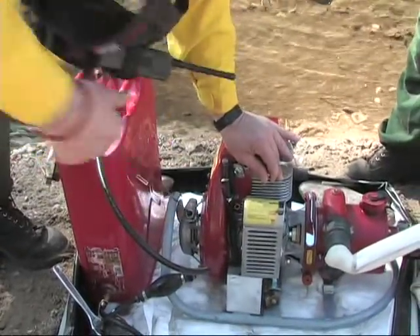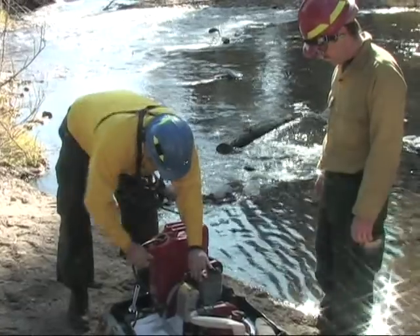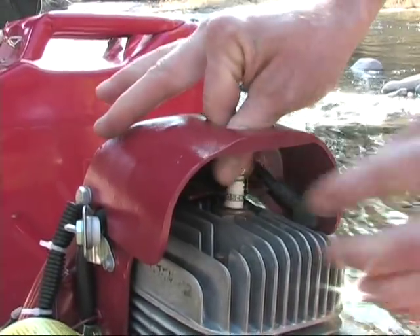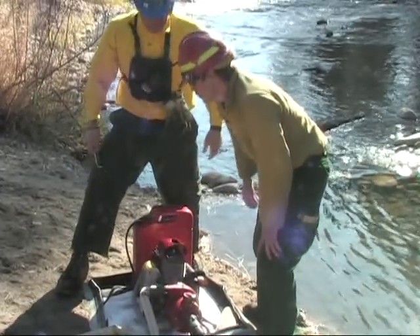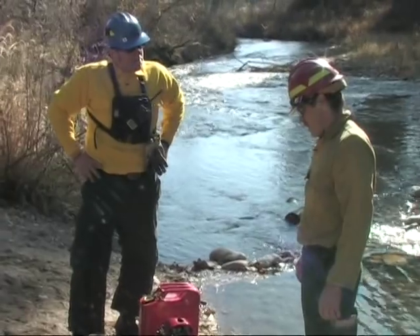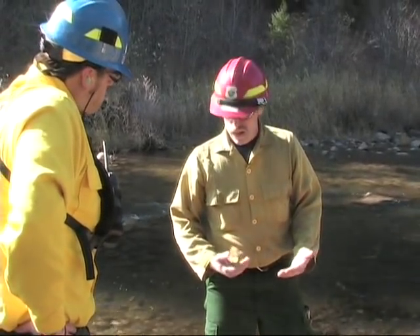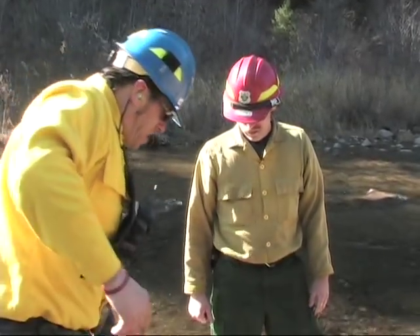You smell that fuel? Oh yeah. Okay, should be unflooded. Let's put the spark plug back in and the cylinder drain plug back in. That's tight. Okay, let's hook that fuel line back up — she's hooked up. Okay Tom, let's leave it in the run-run position with the throttle and choke, and give it a couple pulls and see what it does.